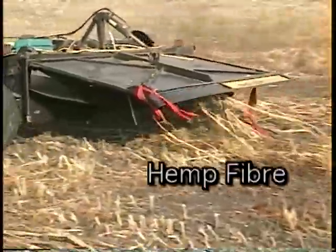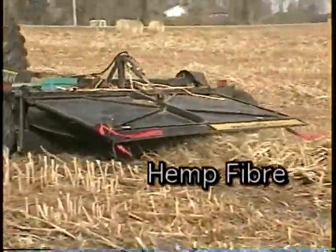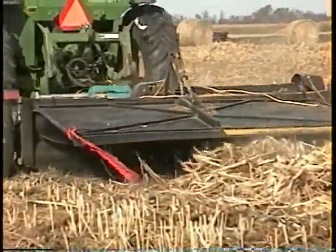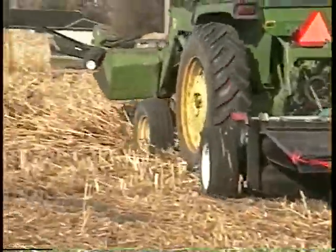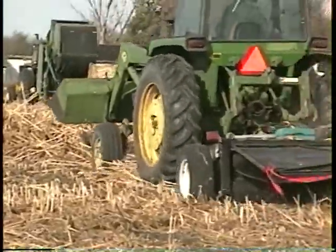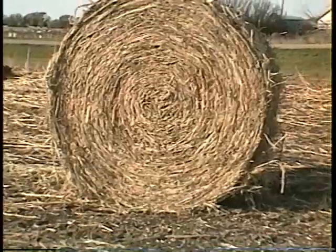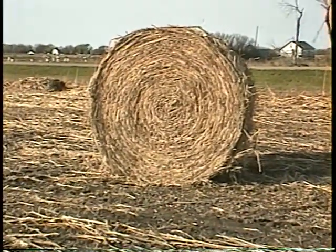Do you grow hemp for fiber? AgShield has developed a hemp kit for the ReCon to dry and soften the hemp plants before baling. After conditioning the stalks, round bales were easy to start, and bale weight went from 850 pounds up to 1,200 pounds in a much firmer bale that was much easier to handle.